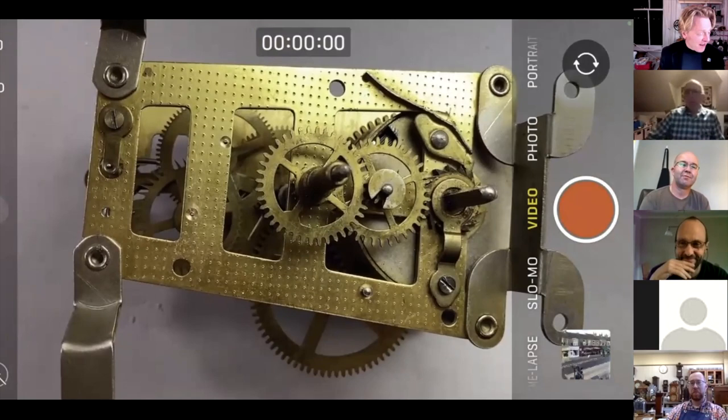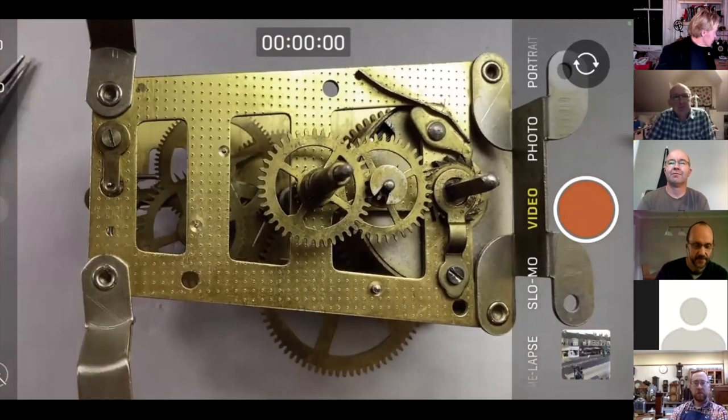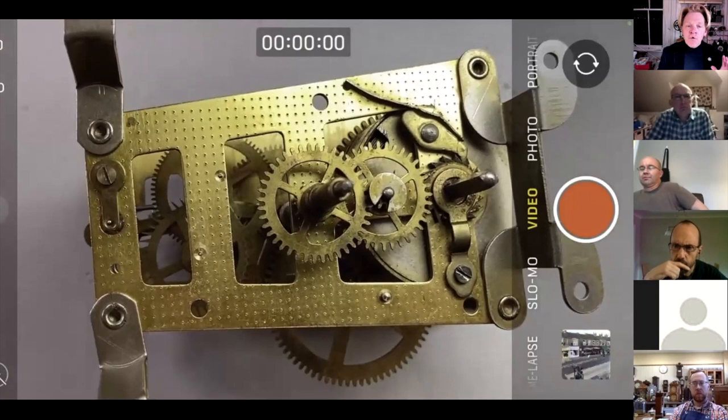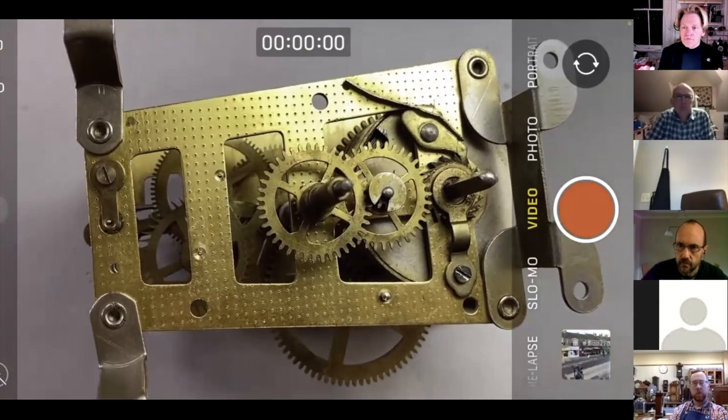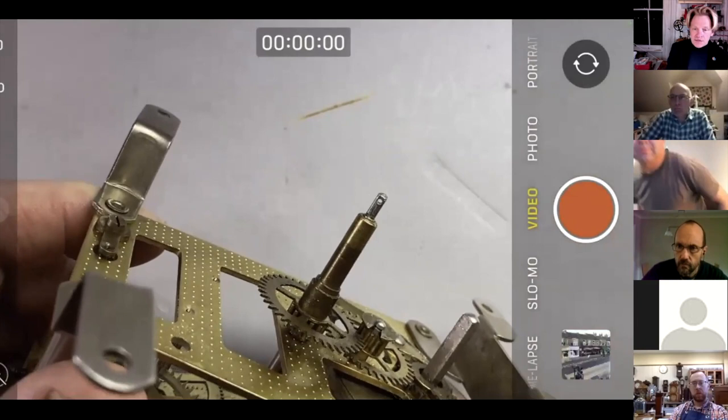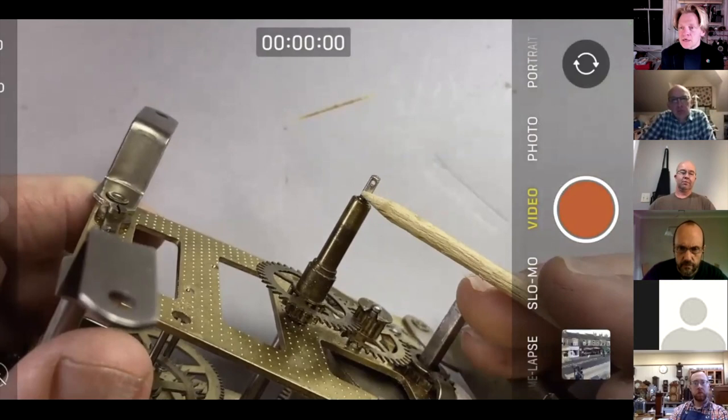Right, okay, let's get this clock apart. I don't quite remember what page it is, but in our book on disassembly, we make leaving the pinion optional as a reasonable adjustment for the beginner. I'm glad we did that, because what I've seen on online forums is people trying to get these pinions off and really mashing into the thing. If you look at the square here, sometimes this hand is retained by a taper pin and collet, but sometimes there's also a thread here with a knurled nut.